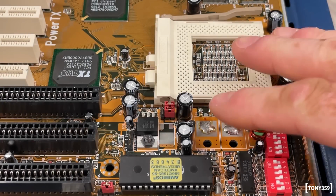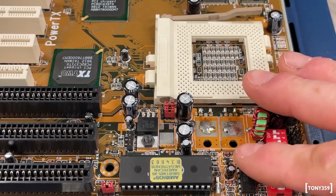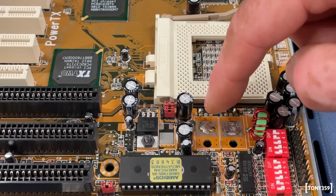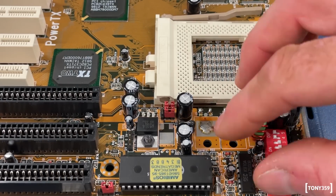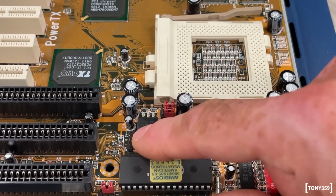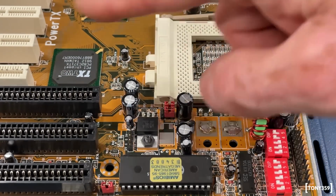Right, I've done a little bit of poking and troubleshooting off camera, and I think I got a reasonable understanding of how this thing works. First of all, this chip here is a switching controller. This controller with the MOSFET, the diode, the inductor and these capacitors, it's actually a very small switching mode power supply. While this component here is just a linear voltage regulator, which is an adjustable one. So there's a couple of resistors there. I don't think it goes anywhere else.